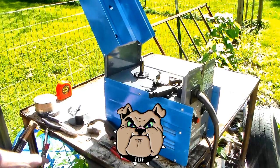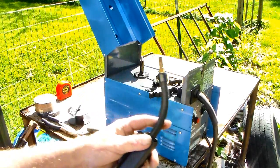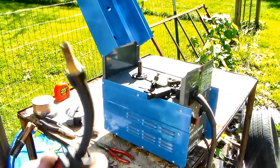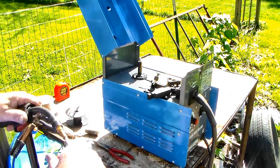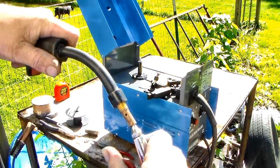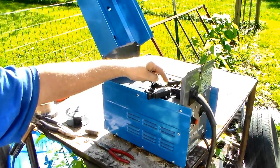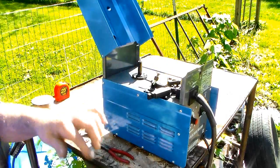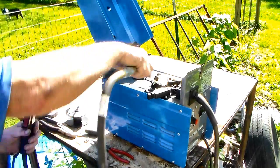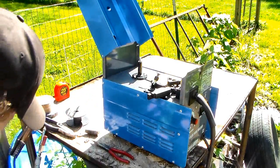Tip that I like to do every time I put on a new roll of welding wire, I take my nozzle out and my cover off, and I blow compressed air through there after I've got the wire out. And if you watch right in here when you do that, you'll see dust and stuff come out of that inner shield. I just blow everything off,